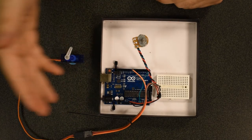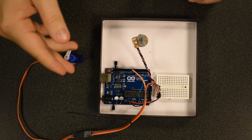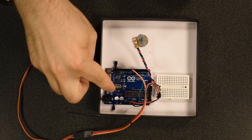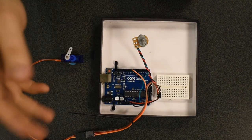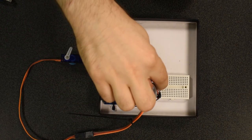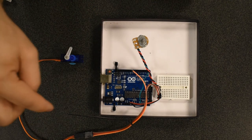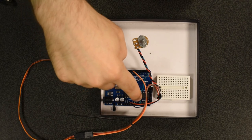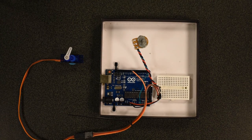What I've set up here is a small test rig so we can try out this servo. This is straight out of the Arduino servo demo tutorial you could look up. We have an Arduino Uno with power going to this breadboard. This breadboard's only used to send power to various places. Power is being sent to the servo on its ground and plus wires here, with the signal for the servo coming from pin 9. And we have a potentiometer we've added that's plugging into analog port 0 and getting power from here. If I attach power in the form of USB,